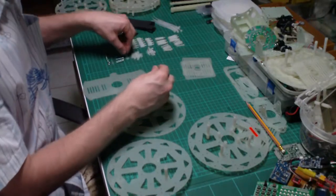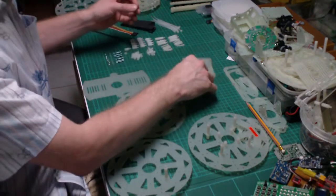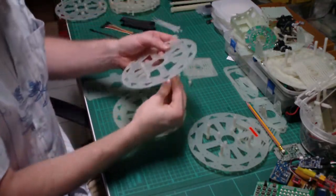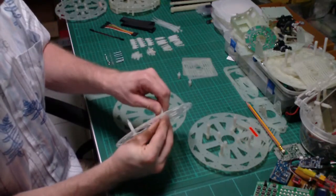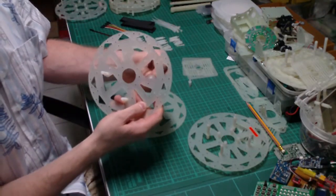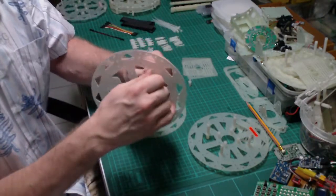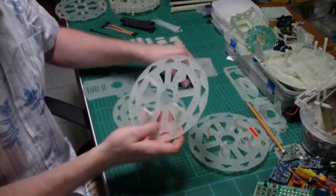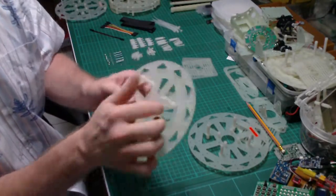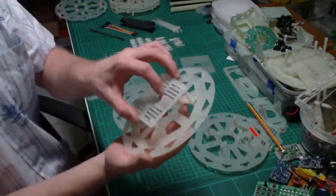Put them all in — there's one, two, three, four on that one corner. Tighten them, but not too tight, otherwise you might break the nylon. Nylon is nice because it usually doesn't loosen by itself once tightened. Now we have all four in. We can test that the carrier board fits — yes, the carrier board fits perfectly. So we have the right holes.